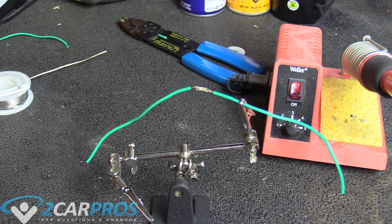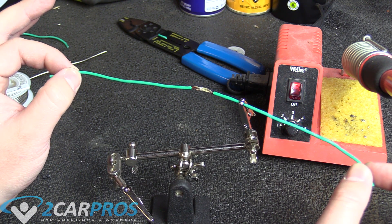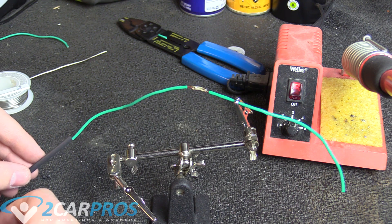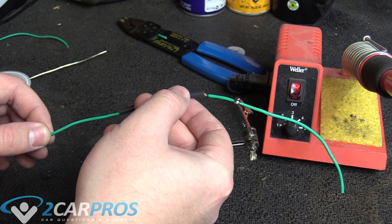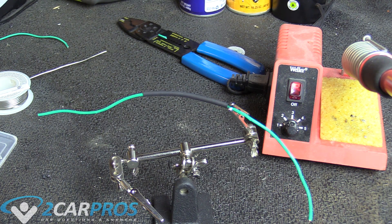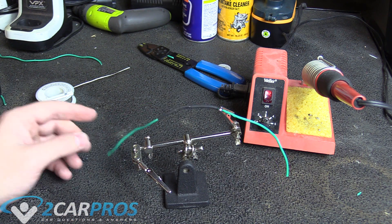The cool trick about this is now you can hold the wire with one hand and the soldering iron with the other, touch them together, and solder these two together. Now that our two ends are tinned, we can solder them together — just apply a little heat from the soldering iron. And that looks pretty good. If you're working in an automotive situation where both ends are connected to something, try to give them a little pull test — just tug on them lightly; don't yank them. If they stay together, you're in good shape. Remember to put your heat shrink on before you start soldering. You can cut your heat shrink to length — I'm leaving it nice and long. Now we can use the heat gun to shrink the heat shrink.